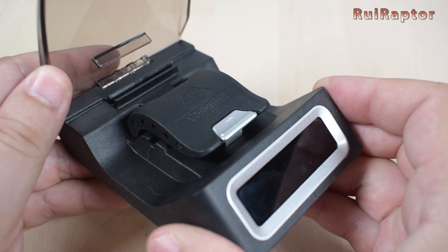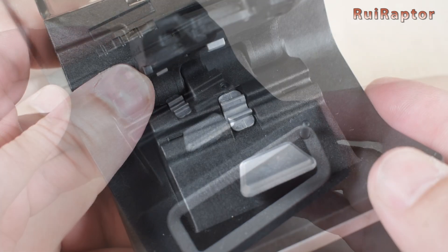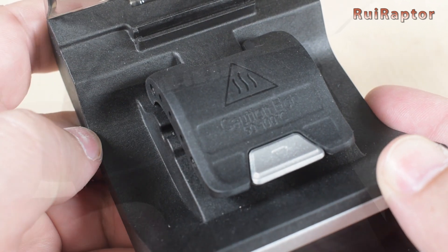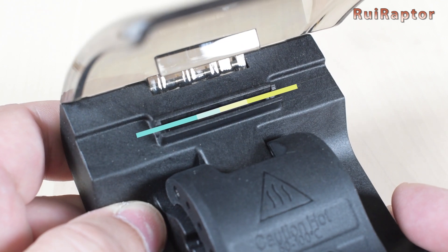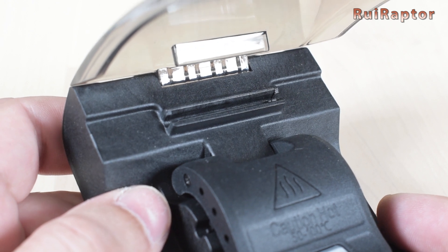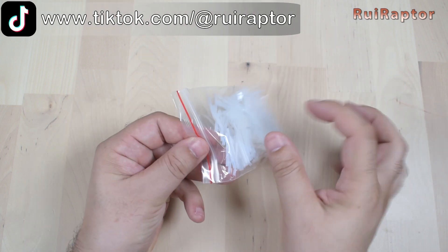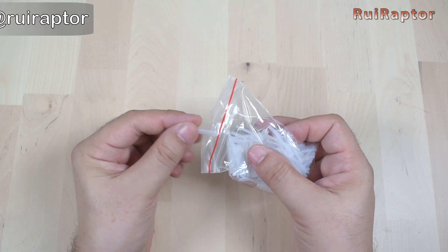At the top is the cover and then a small lid. Under it is where the filament tips are heated up and bonded to each other. Next to it is a small slot used to insert the filament once bonded with the PTFE sleeve. When closing the top cover, it will cut the sleeve, making it easier to remove. The sleeves in the bag are 26 mm long, which is more than enough to hold the two filament ends together.